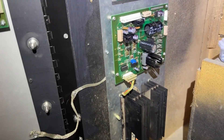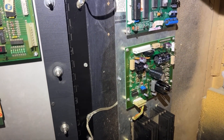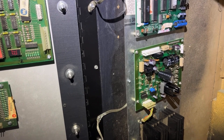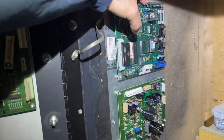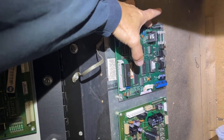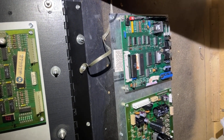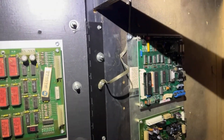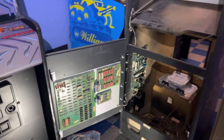I'll have to figure out the pinout. I try to buy a manual for every single game I put together, especially because it's nice to go through the wiring schematic and figure out exactly where stuff plugs in. If you guys remember on my Sinistar video, I had accidentally plugged my volume pot and the speaker backwards. I'm pretty sure I just screwed that up because I kept taking the board in and out.